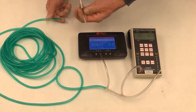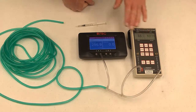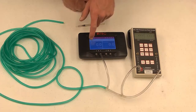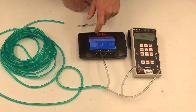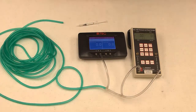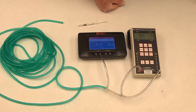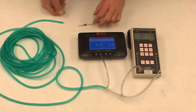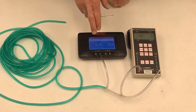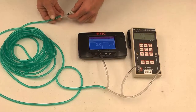I'm going to pull out the syringe and let the pressure out of the hose. I'll change it back to one second time average — it's easier to get to the pressure you need on one second, then switch to 10 seconds so it holds the reading long enough to write it down. Our next pressure to check is positive 50 pascals, and we should be within 0.5 pascals of pressure compared to our standard gauge.